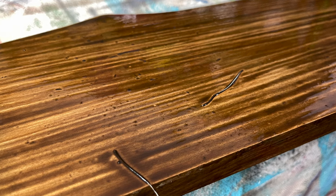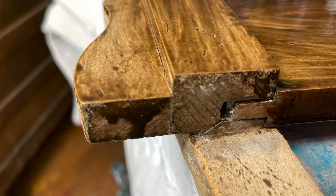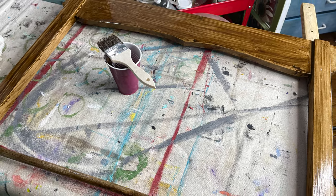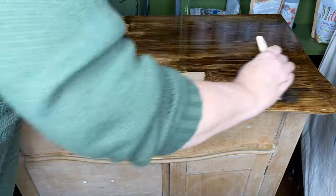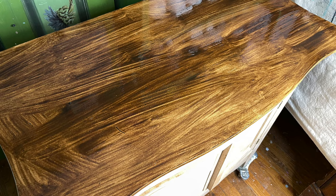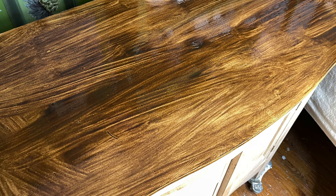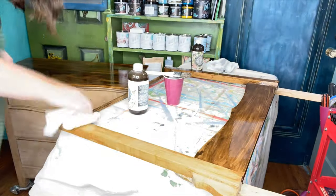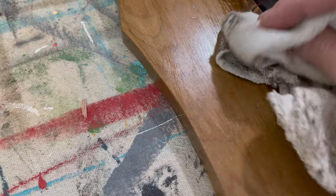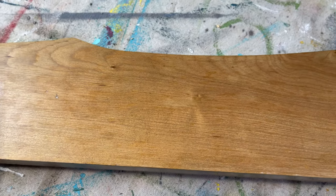If you lose brush hairs, we'll get rid of them later. You might also notice that the oil wax can get a little drippy — feel free to smooth it over with your brush. Since you're going to leave the oil wax on for 15 to 20 minutes, I recommend doing the piece in small segments and use a timer. You can work on one area while another is setting — just don't leave it on longer than 15 to 20 minutes. When the time is up, grab a rag and wipe back all of the excess oil wax to reveal the beautiful color of the wood underneath. Then grab a clean cloth and go over it one last time to get all the residue.